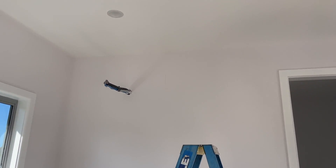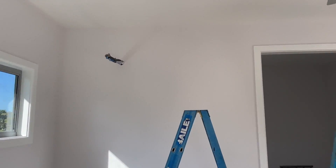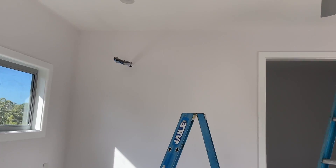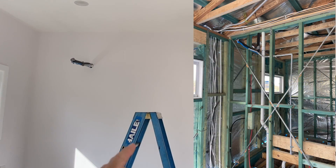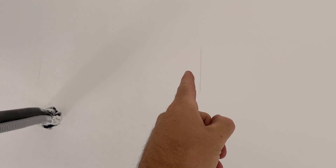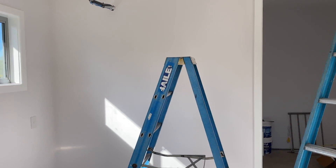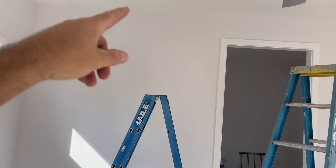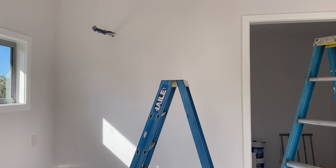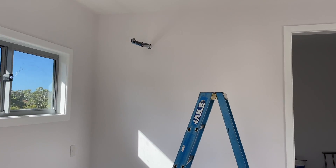When I came and roughed this in, I got the center of that wall and that door. It's tricky because there's no plasterboard, it's just timber, so you need to allow for the architrave around the door. I was just double checking - in between the architrave and the corner, that's dead center, and across to the edge of the unit. I just want to make sure these brackets are in the right spot, and they are absolutely in the perfect spot. It's always a little nerve-wracking when there's just timber everywhere and no architrave - you've got to try and pitch everything in position - but that's worked out well, everything's in position.